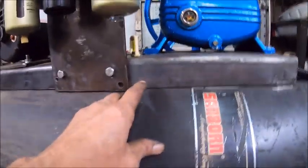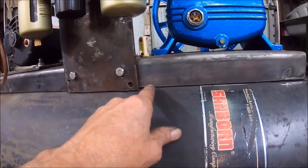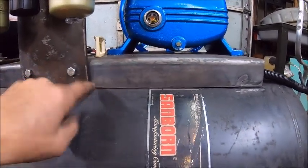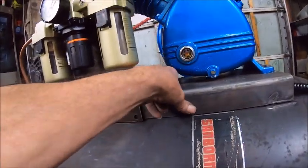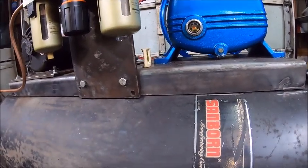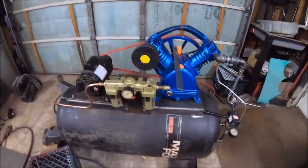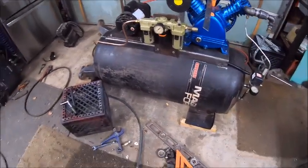If I really went into this all the way, I could cut some relief right here and just reach up in there and put the nuts on it, but I don't like messing with nuts underneath this thing. I'm just going to weld them to it - that's the same as threading this metal. I probably could have threaded it since it's thick enough, but welding will give it a more solid hold that stays tighter for longer.